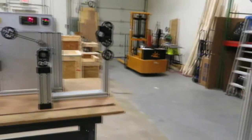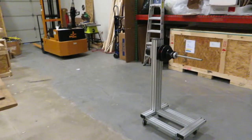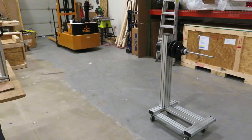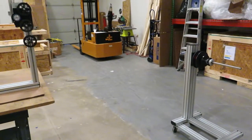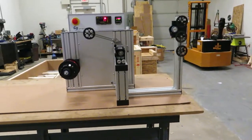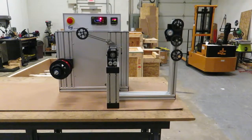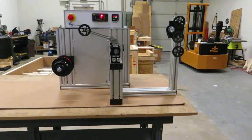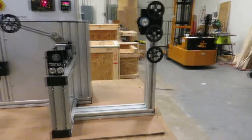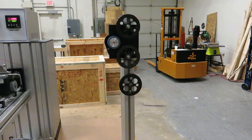Here we've got the wire being pulled from a spool over here on a floor-standing payoff unit, and it could be going through an annealer or a cleaning process or some other situation where the wire needs to go at a consistent rate. We're doing that by tracking the speed very precisely through an encoder-based length tracking assembly.